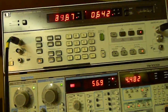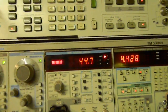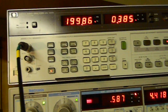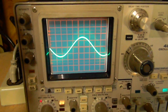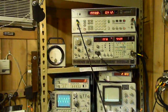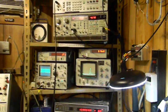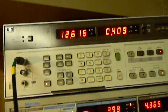Let's sweep it again — there you go, and it should sweep all the way up to 20 kilohertz. You just punch it all in here; it's great, I love it. I don't have to use any of these filters. The 80 kHz filter is on for whatever reason — I think with no filter on the bandwidth is like 750 kilohertz, I believe that's what the book said. You can see the frequency increasing each time. You might be able to hear the transformer squealing — it's a marvelous device.